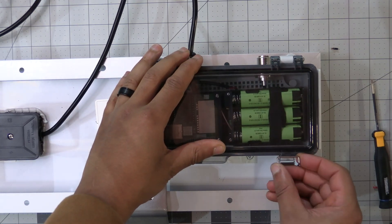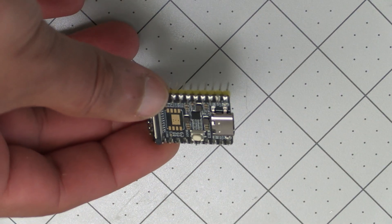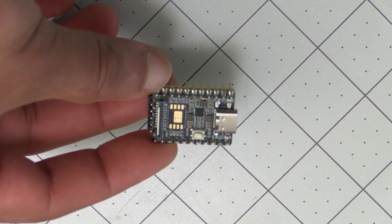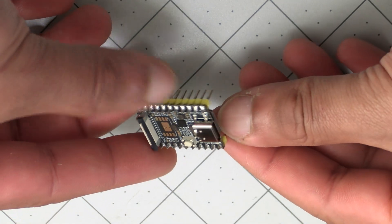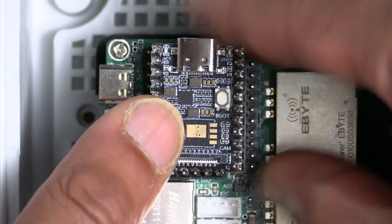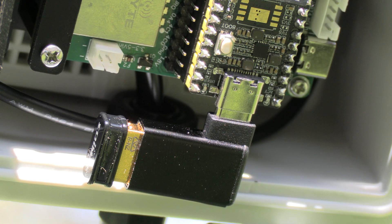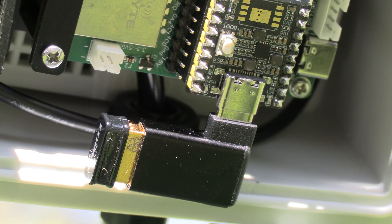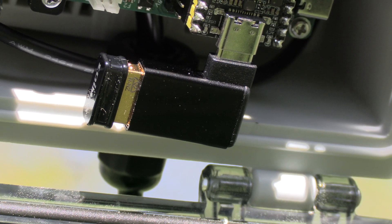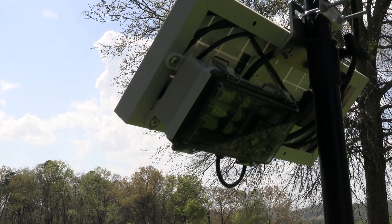Once that's done, we're all mounted and good to go. There's one final thing before mounting outside: getting the SD card flashed for the LuckFox and installed on the Femto Fox board. Since this video is already long, we'll do that in a separate video linked in the description. Once flashing is done, the LuckFox just gets inserted on top of the Femto Fox board. If you're using Wi-Fi, the kit also includes an angled USB-C adapter to make the Wi-Fi adapter fit into the enclosure — insert that into the LuckFox board as well.